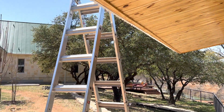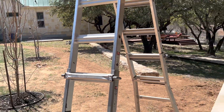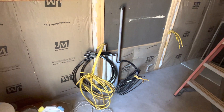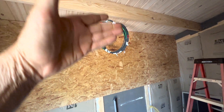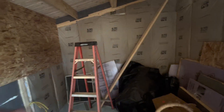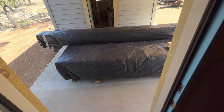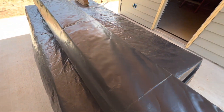We've also pulled and run all the conduit from the electric panels over and into the building — all of that is now inside. This piece of plywood will be behind the false wall. In the next video you'll see this false wall, which will have all the electrical components mounted to it. All of these walls will then get covered in radiata pine plywood, and pine shelving will be used throughout.